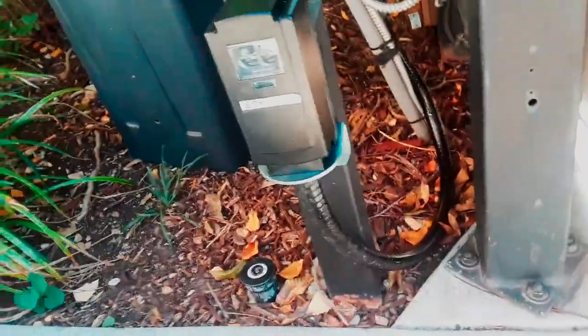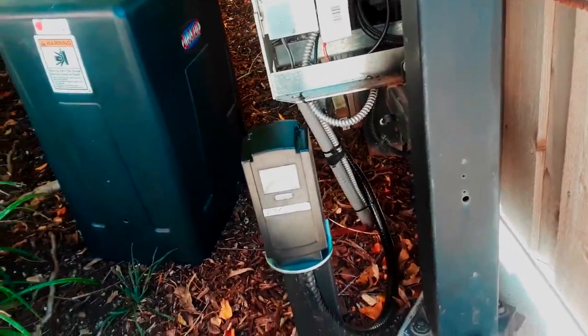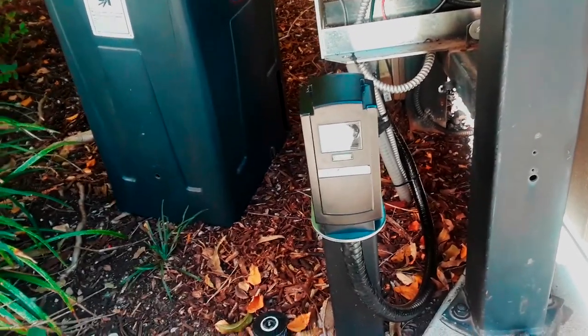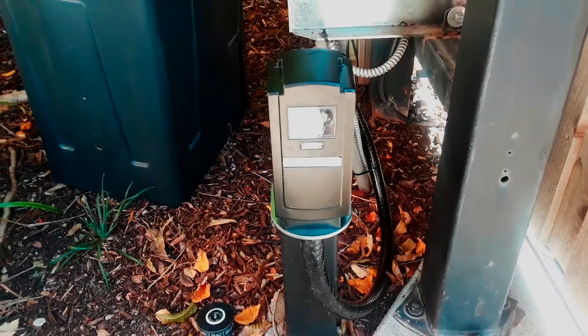The interior-grade wire was going through this metal conduit which runs back through the track, so it's probably just sitting in water underneath there and one of the wires is damaged — at least that's what I diagnosed. When we took the photo eye out of the circuit everything worked fine for a little while, and this was a logical step up so we didn't have to replace the wire. It's a perfect retrofit.